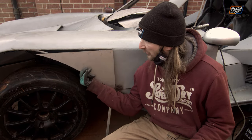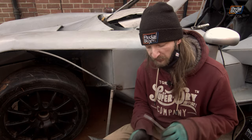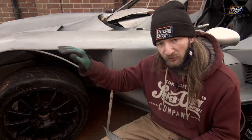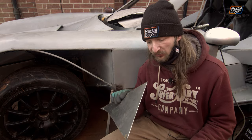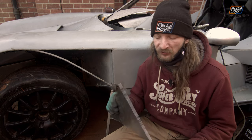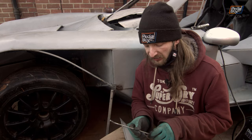Here's the piece of metal we're going to use — the side panel. We've already cut this down more or less to the right shape and size, but like everything else on this car we have to have a bit of a radius on it for safety reasons. The IVA is fairly sensible: because it's only a vent and not a protruding front edge, you don't need a big 5mm radius — we can get away with about half a millimeter. This is fairly thick material so hammering the edge over would probably meet safety requirements, but to give ourselves more safety room and add strength, we're going to use this piece of steel rod — the same stuff we've used around the tail lights.